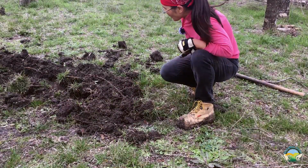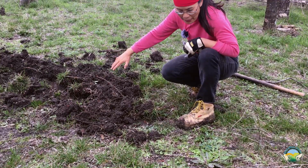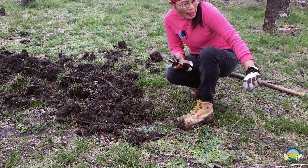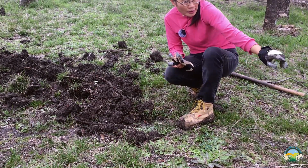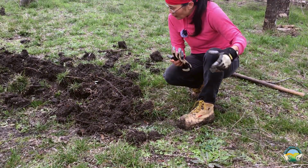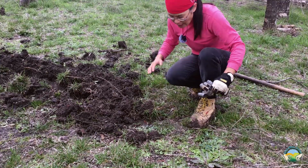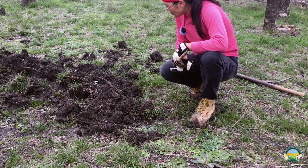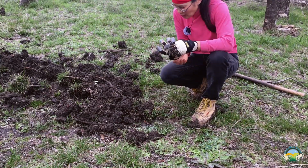Over there is the higher ground, and so I basically dig the trench, come up over here, and down that way is flat. I already see some very moist soil over there, indicating water accumulation. So what I'm going to do is connect the trench to that area, and so all the water can come around and drain over here.